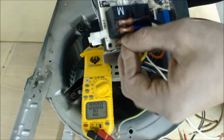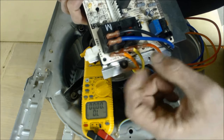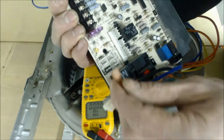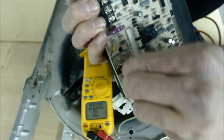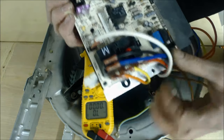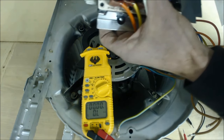For safety reasons, go ahead and put unused speed taps onto your spare terminals. There is no voltage ever going to your spares — it's just an empty terminal space on your control board. If you do not have spare terminals, you can go ahead and wire nut these, then use some zip ties to hold them up out of the way to keep them safe. Then go ahead and put your white common wire onto your L2 neutral common bar. That's how you set it up. This is a five-speed motor, but you can also run into three-speed or single-speed motors.